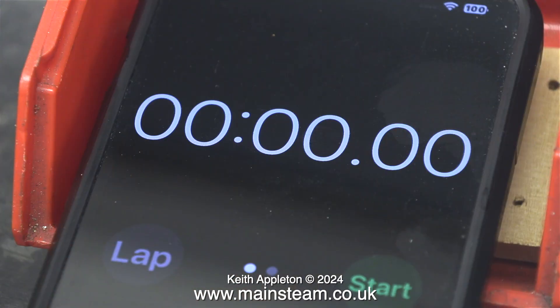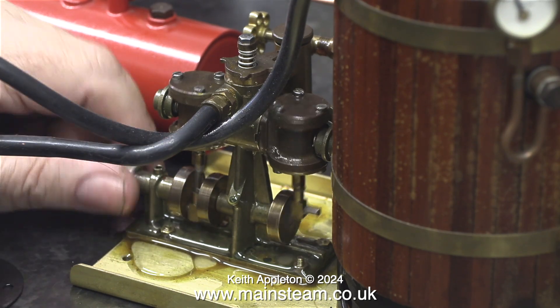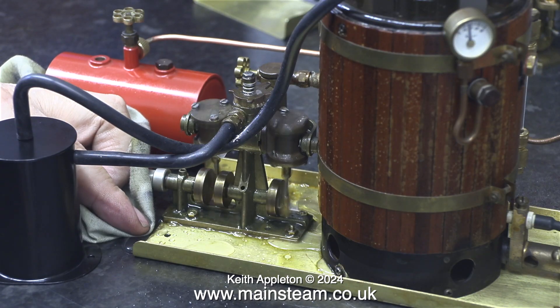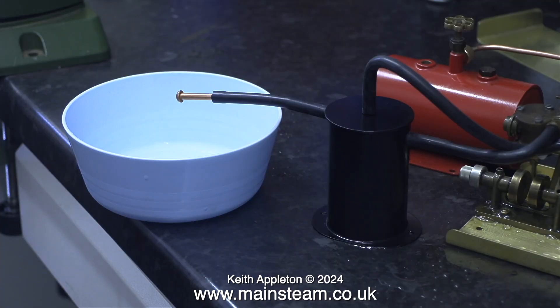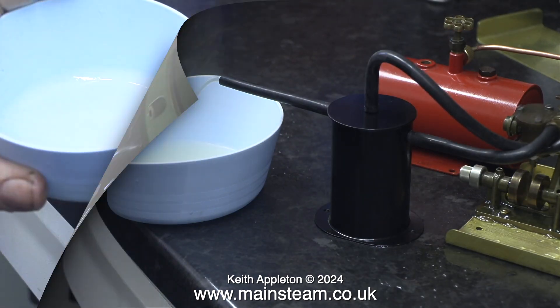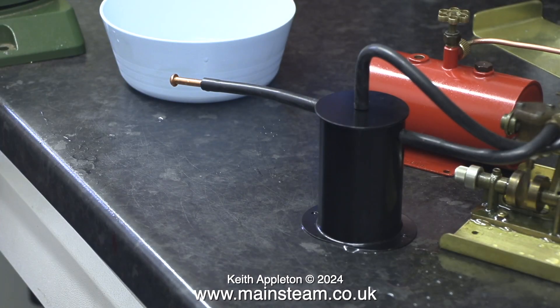Once the engine starts I'm going to use a stopwatch on my mobile phone to time the duration of the run. This is what I thought would happen — the boiler is over full, and as it's raising steam, once I open the steam valve it just admits water to the engine to start with, which runs everywhere all over the base plate. As a general rule it's better to fill the boiler three quarters full. It's much better now the steam plant is fitted with an exhaust condenser — this is what it's caught so far and the run hasn't really started. Most of this condensate was from over filling the boiler.